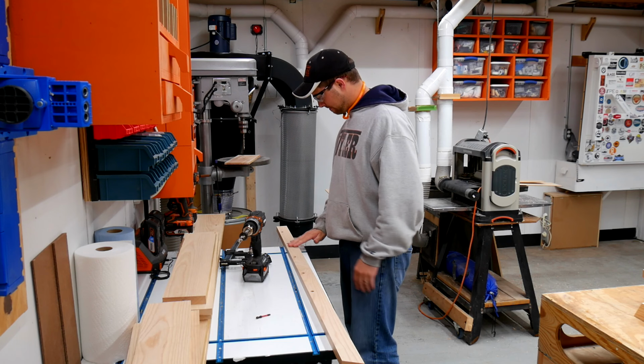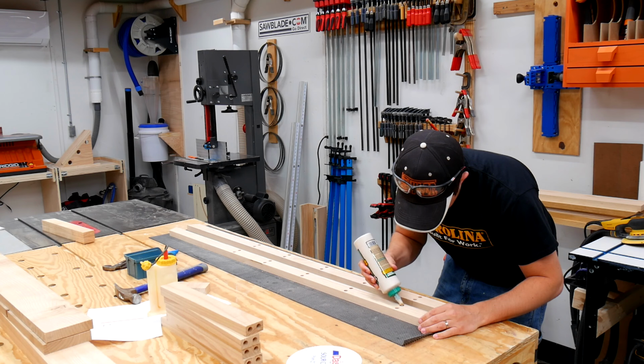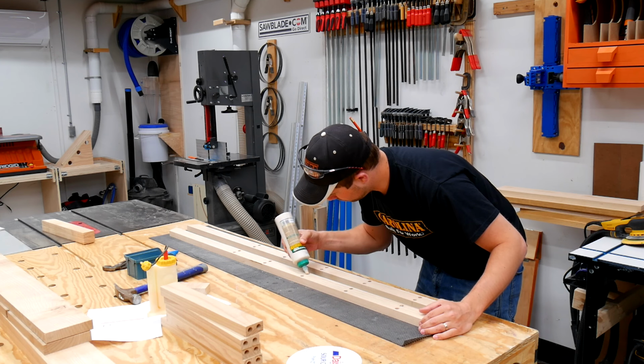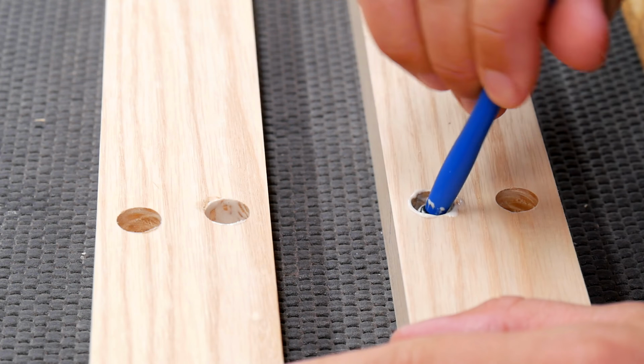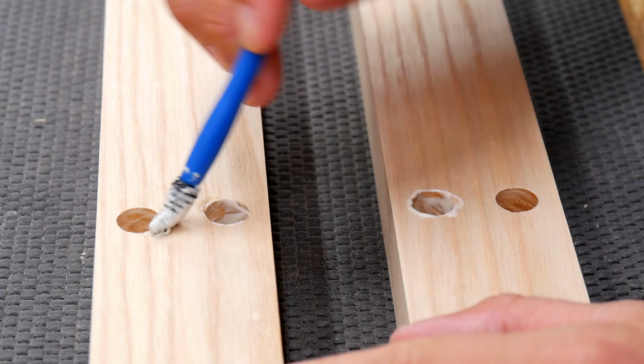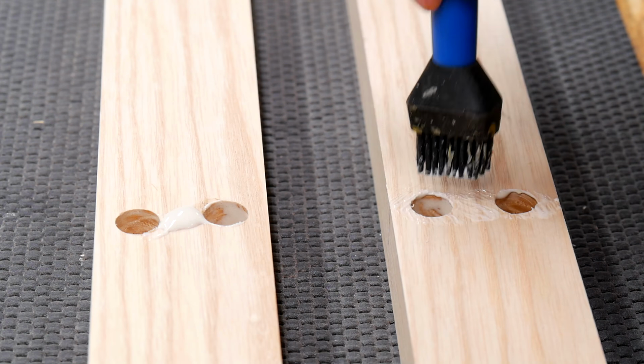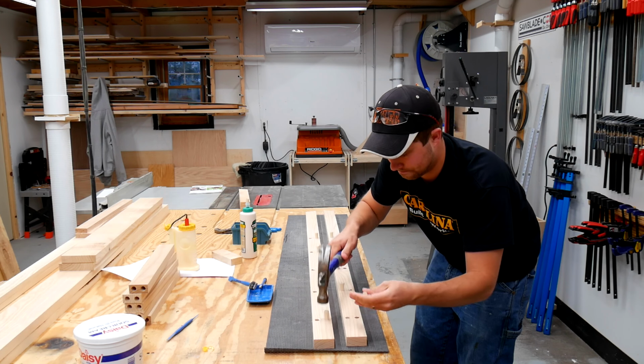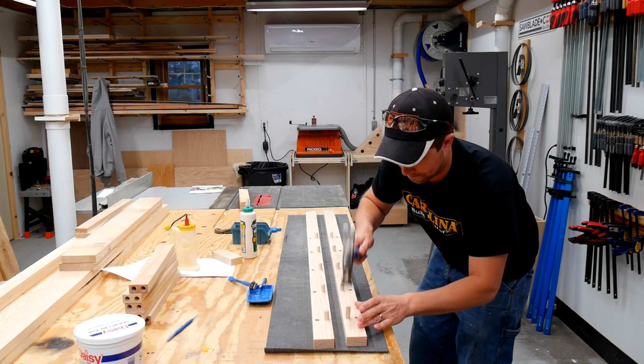So you will see when I'm doing the final assembly, I actually only put 1 dowel on each side of the board, and that allows me to rotate it back straight and level so that I can get a nice even step and a flat step on the ladder when it is glued up. And it is little kids going to be climbing on this, so I think with the wood glue and a dowel on both sides, we should never run into any issues.